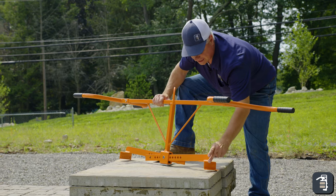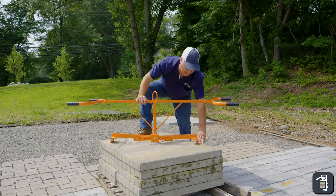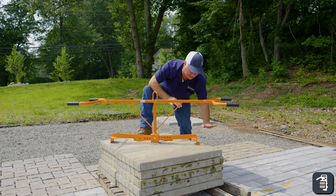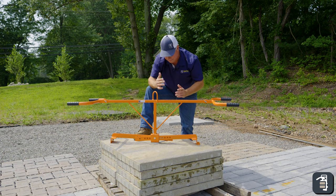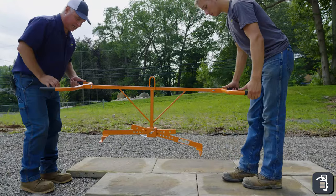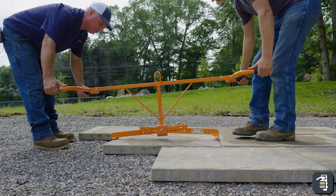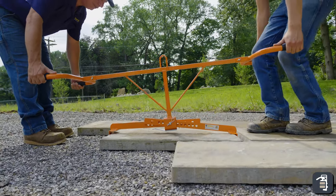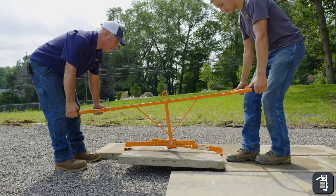You'll notice on this side it has a flat tab — this is very unique to the design. When we're setting it up against our last laid product, this tab will rest on the last laid product and actually releases the product down into the laying field. So if there's an issue on a job site where I can't have product on this side because of the flat top tab, I can get in there, pick up just a little bit, slide it, get full depth, pick the product up and re-level our setting bed if there's a problem.